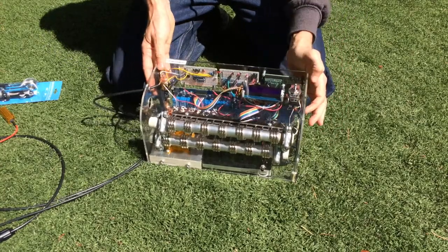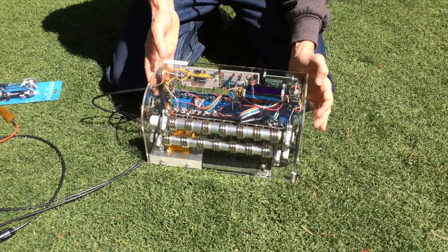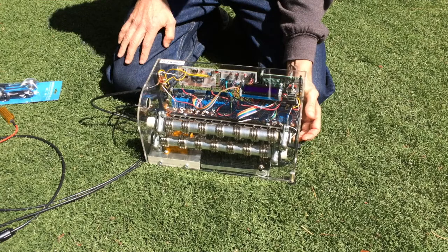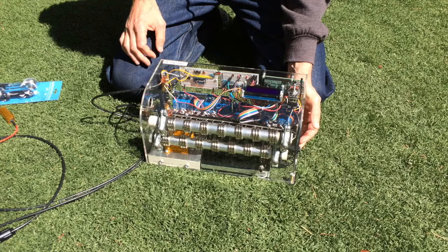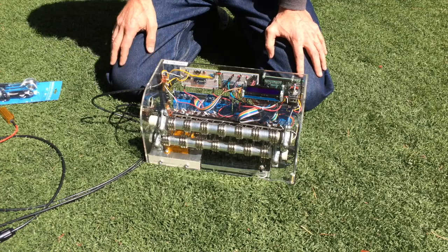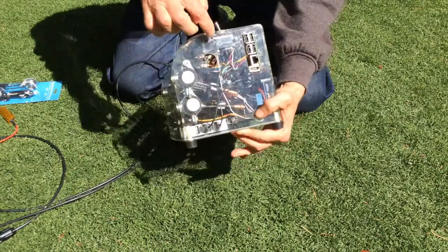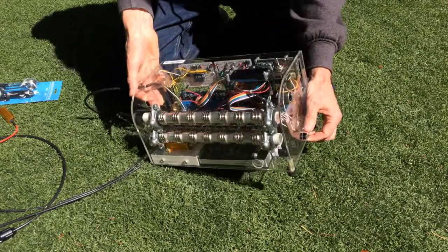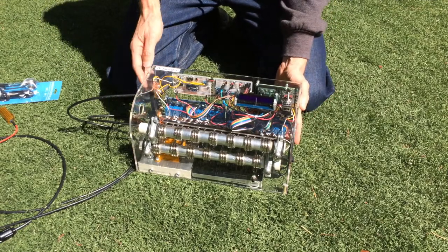This switch here is part of the load chain. It's a double-pole, single-throw switch which breaks or makes the circuit through the load. It's double-pole so the other side can signal to the computer the state of the switch — whether it's open or closed. I also have a snubber on that switch, though right now it's not really needed because I use one of the relays to open the circuit before this switch is used to open it at the end of the test.